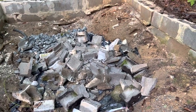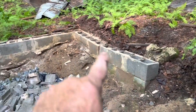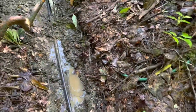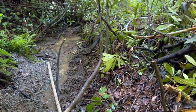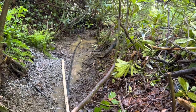Probably going to get another bunch of gravel right there, but it's covered. We're going to leave this wall so surface water that runs down from the woods doesn't come in here. There's the drain tile pipe and the water supply line going out. I was able to run it inside their old inch and a quarter pipe, using it as a piece of conduit all the way to the tank.